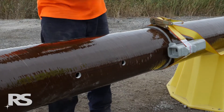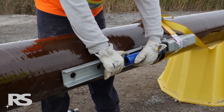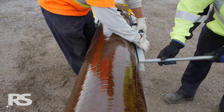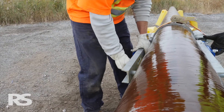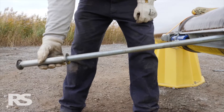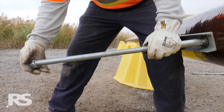Place one of the hydraulic cylinder rams into the base of the upper bracket. Line up the ram with the drilled holes and slide the 1 inch or 25 millimeter threaded rod through the pole. Place the other hydraulic cylinder ram on the opposite side of the pole, sliding it over the threaded rod. The spacers from the kit can take up slack on the threaded rod. Hand tighten a nut onto each side of the rod.